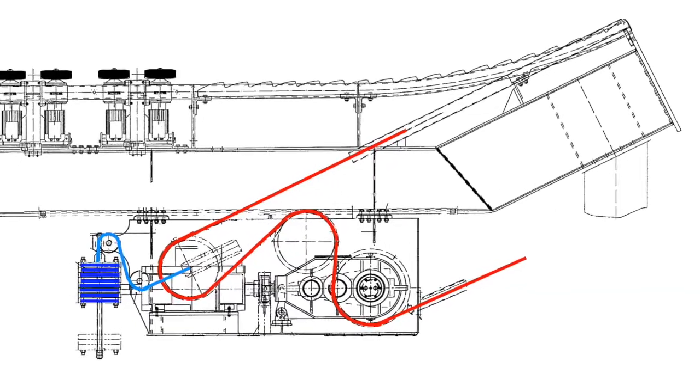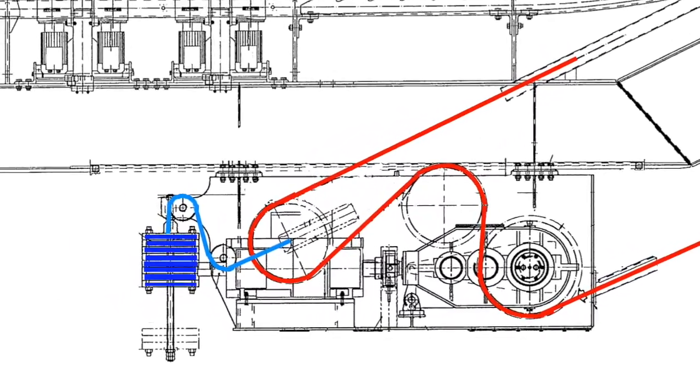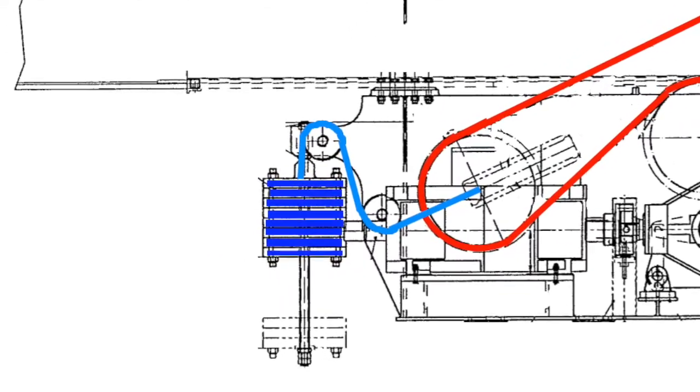Along the lines of chain tensioners, there is not always a spring pulling that chain back. Most of the time it's done by weight. You use a very large weight to simply pull on that tensioner sprocket backwards, back down. And then some rides use spring tension. The SLC used giant springs to push the idler sprocket or the tail sprocket backwards to create tension. And some rides don't use any but the chain's weight.